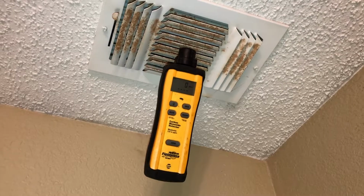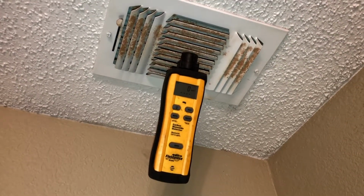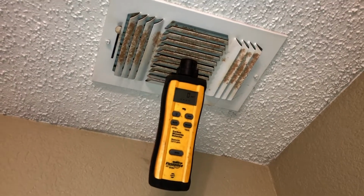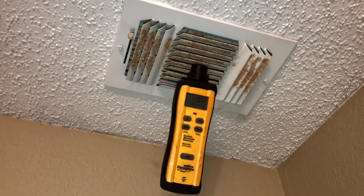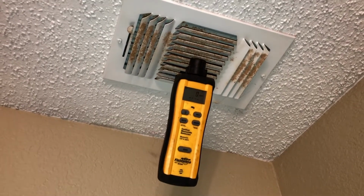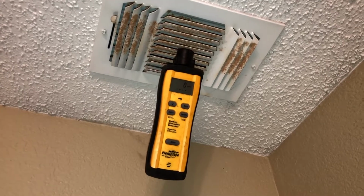But anything past 3 parts per million, I shut them off. But even at 1 part per million, there's something going on there that's not right, and you've got to talk to the customer about it and let them know that they do have a hole somewhere in their heat exchanger. It may be a small hole, but they definitely have a hole.